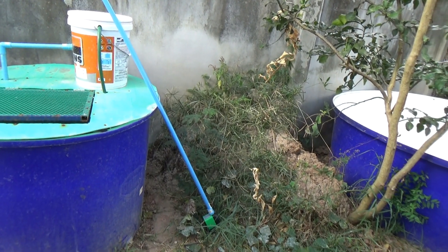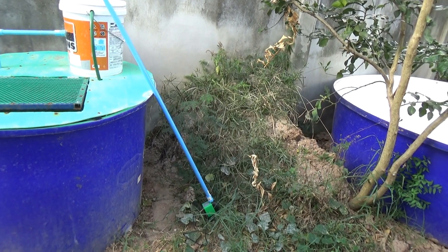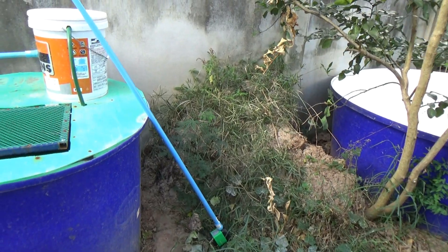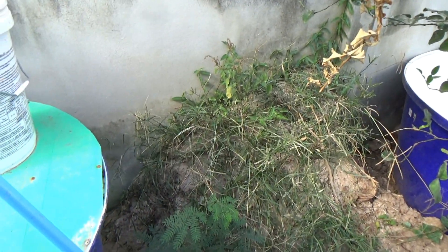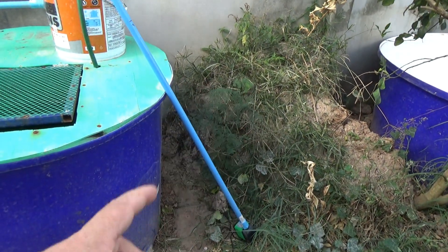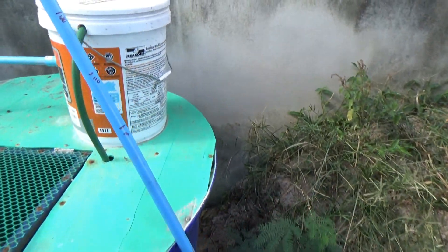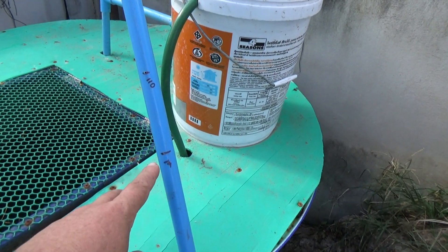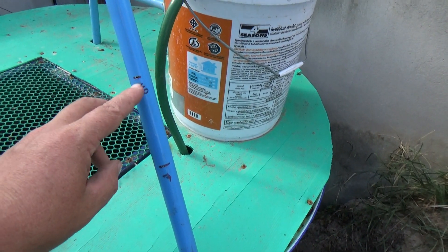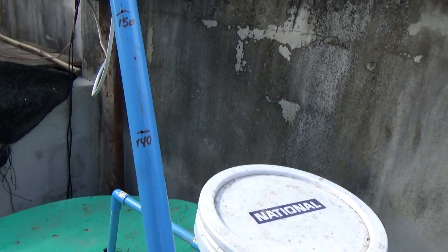I'm not going to check the 1800 liters per hour — I know that's a lot more than this pump can do. I judge them by the size compared to the other pumps I have here. What I've done is taken this 1.5 inch pipe that screws right into the pump. It's at 1 meter and every 100 millimeters after that I put a little hole, and we'll see how high this water actually goes.